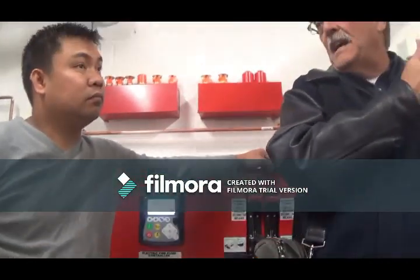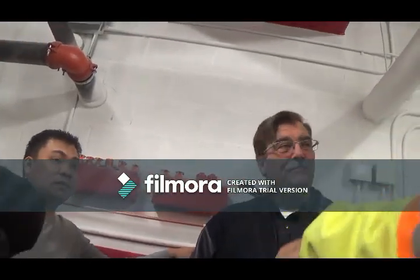We just did the setup as per the engineer. Sorry to interrupt, you have low flow faucets here. Okay, yeah, that's what I'm asking. They're supposed to be 0.5 GPM, which is nothing. They're garbage. I don't like it, because his sink is not the same as my house. His sink is the same as the sink on the 10th floor, the 15th, the 5th. It's all 0.5. When they do it, they save money.